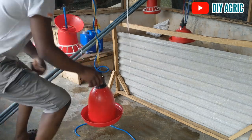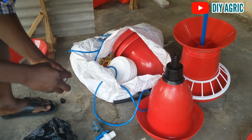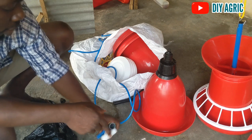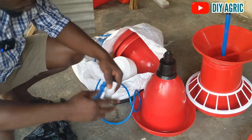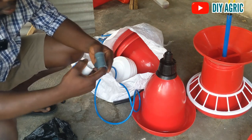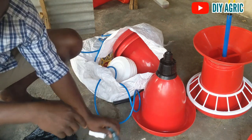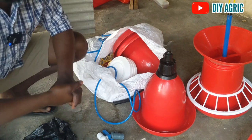That's pretty much how to install the drinker. You'll be needing gum when connecting the pipe. The accessories that come with the drinker plus what you need to buy: an air valve half-inch, a T-fitting that's three-quarter to half-inch, and a half-inch socket component that has threading. Aside from these, you don't need anything else — just connect everything and it starts to work.